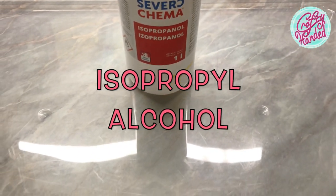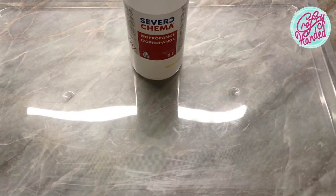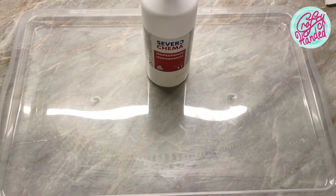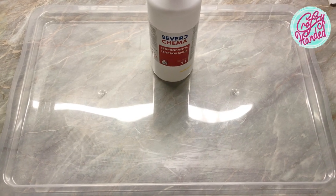It's important to not wash your keyboard body in water — use isopropyl alcohol instead, it's great for cleaning circuit boards. Read safety instructions, work in a well-ventilated area and be miles away from any fire source. Remember that even vapors can ignite.